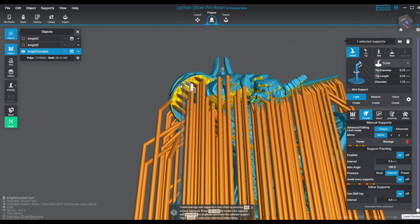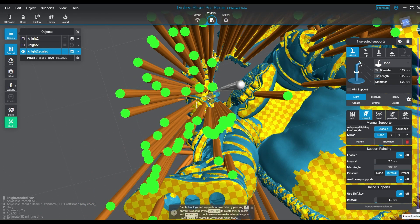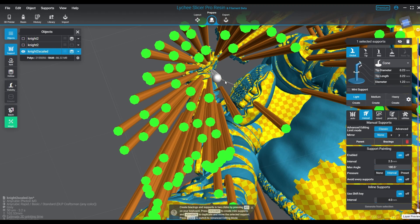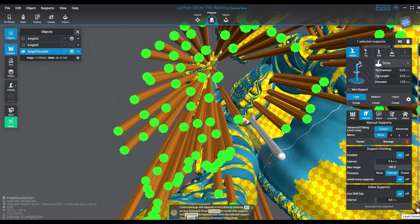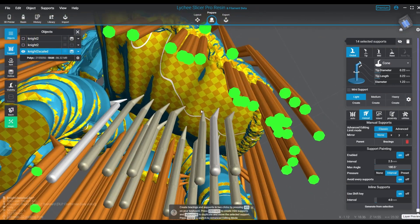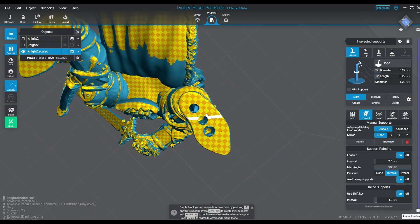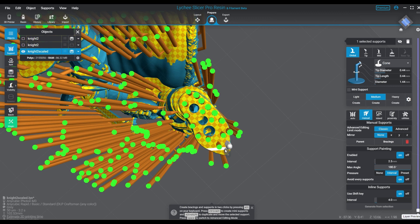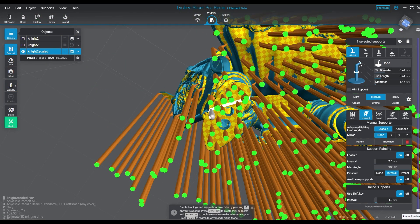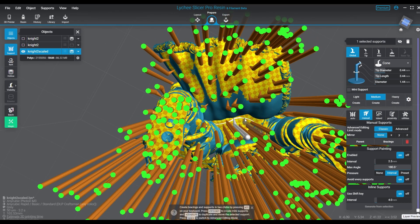The argument could be that using this many supports, they're bound to get clustered together — you're bound to get what you call tree-trunking, where bigger chunks of supports get stuck together. We usually try to go in and refine that a little bit before printing. To me the most important thing is the ease of removing support, because we do so many prints and we're constantly removing supports. We need to focus on how quickly we can de-support a model, clean and cure it, and move on. We're always working in bulk — several build plates at a time, several pieces.